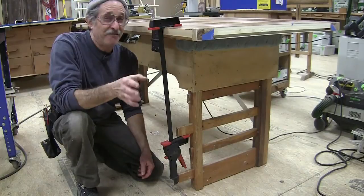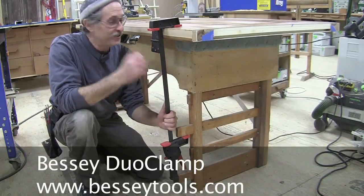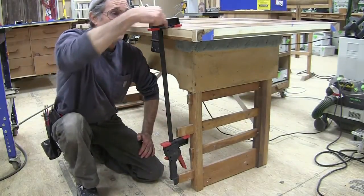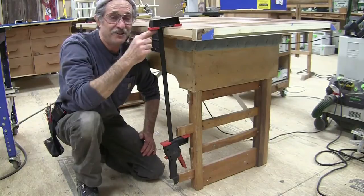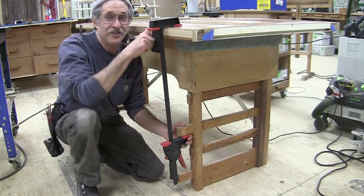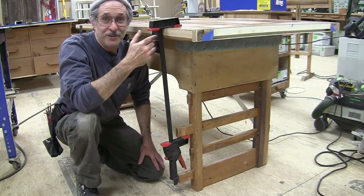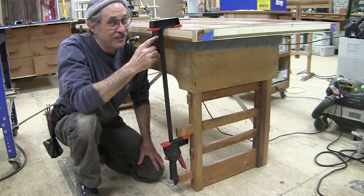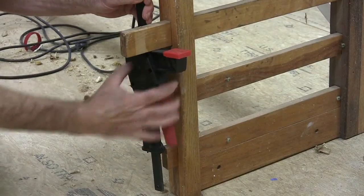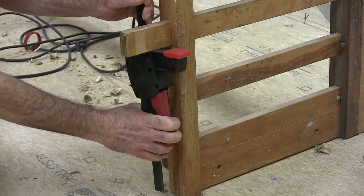Sometimes you can't do anything right unless you have just the right clamp. I'm using Bessey's dual clamp — these are the most awesome squeeze-grip clamps I've used. They're one-handed, you just squeeze them tight. What I like is they have such deep jaws on one side and a regular shallow jaw on the other, so the deeper jaw can stretch all the way across from the rung on my door bench to the top of the door. If I didn't have the door clamped in securely, it would slide around when moving the plunge router, and the router might nick right through the face of the skin. These clamps always grip — they never slip — you can keep choking them down with the handle to get tighter and tighter.